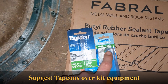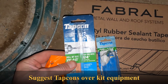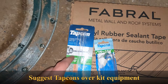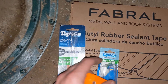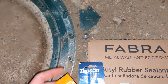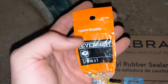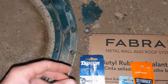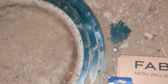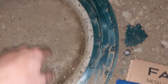The other thing is the screw-downs that come with the kit are not great, so I used tapcons — stainless steel quarter-inch by 1¾ inch. Be sure to use their drill bits, about six bucks, because these drill bits work a little differently than masonry drill bits. Tapcons are pretty easy — they screw in to spread the pressure. I used a fender washer, which is like a regular washer but bigger, for the quarter-inch size. Make sure it's stainless steel so it won't rust.